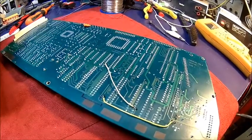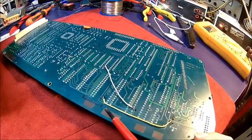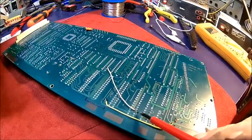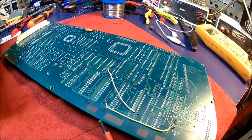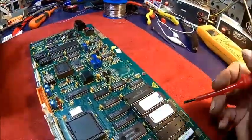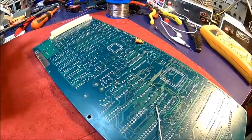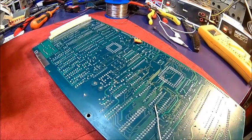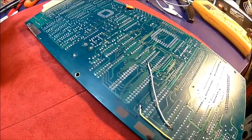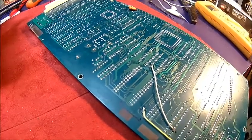We finally found it — it's actually an inner layer, one of the center layers. From here to here: I had continuity on the other side under the EEPROM, then I was poking in the near area for conductivity and found it. That hole has no more conductivity, so we basically bridge the track on the top from here to here — that seems to be alright.